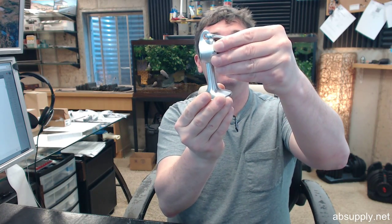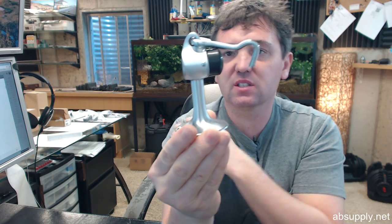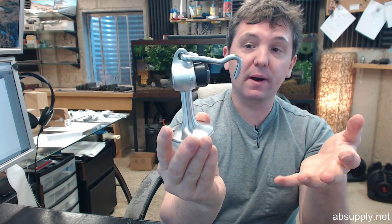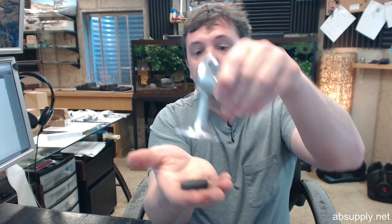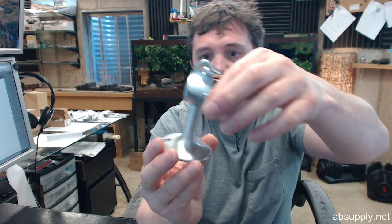Hello, my name is Rich Howard, owner of Architectural Builder Supply, and this video is to bring you a closer look at the DCI number 3367X. This is a satin chrome, US-26D — better called 626 — which indicates specifically that the base material is brass, which indeed it is on this item, and that it is in a satin chrome finish.